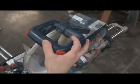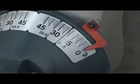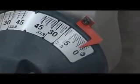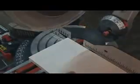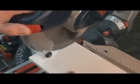Using a miter saw, we now trim the riser to our line. But before cutting, rotate the blade on your miter saw a few degrees so your saw will cut at a slight bevel. This will help us when installing the riser. Precisely cut the riser with the bevel angling towards the center of the riser. Repeat this on both ends.